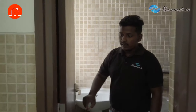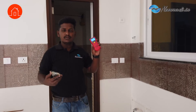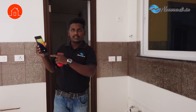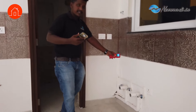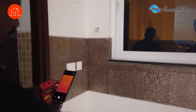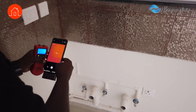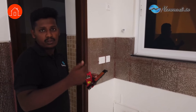Those things we will check. And here is a door frame — you can see these cracks. Now we are checking the dampness. This is a moisture meter — we can check the percentage of moisture content in the walls. And this is a FLIR camera connected to my smartphone — it shows the entire area where moisture is observed, working on infrared radiation. You can see it is showing high dampness in this wall — because of plumbing done here, there may be leakage, so this entire area is damp. You can see some purple color areas which are covered, indicating the entire area is damp. We will do the analysis and it will come in the report.